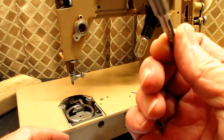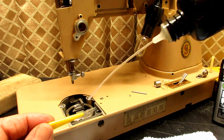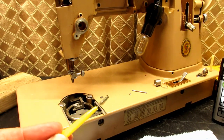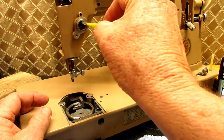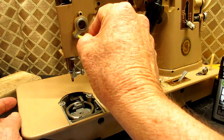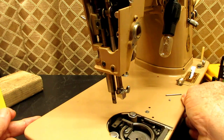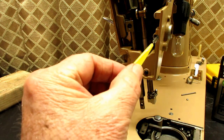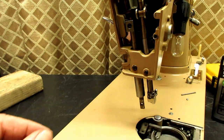When I start, I want to put the tension stud in. There are three little places I use this interdental brush — a Christmas tree shaped brush — and I run it through where the disc is going to go to put a little oil in there, and where the retaining screw for the thread guards goes, and up here in the nose where that long set screw goes. I'm going to oil those threads in there.